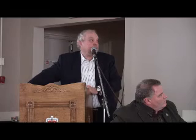Septic systems are actually defined in the building code according to three categories. The tank itself provides what's called primary treatment. This is where most of the activity of degrading the various materials in the sewage down to clear water occurs. Secondary and tertiary treatments are defined in terms of the units I referred to earlier: biological oxygen demand, carbonaceous oxygen demand, and suspended solids. And the Ministry of the Environment has regulations that indicate what these values have to be, and they have to be met to a certain standard before a system is approved as a tertiary system.